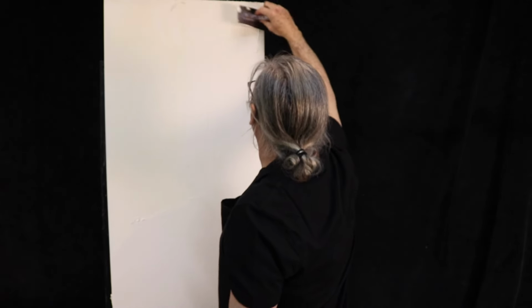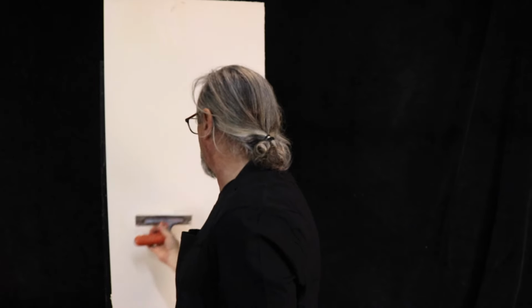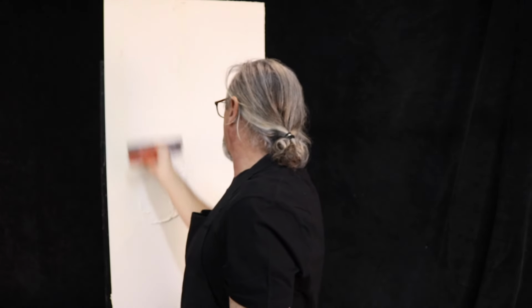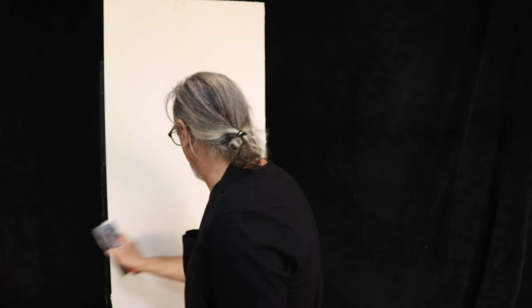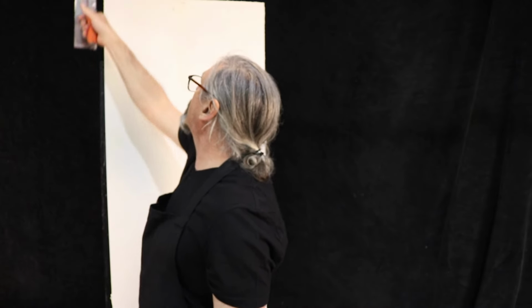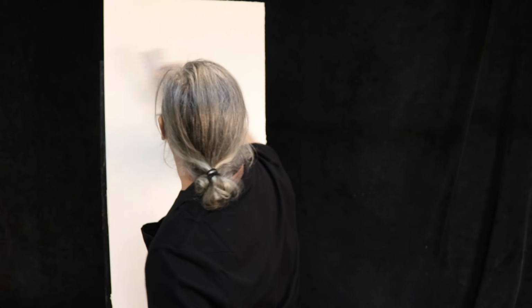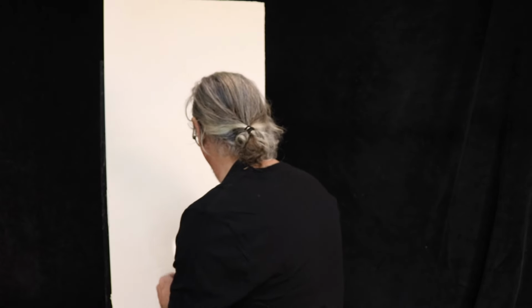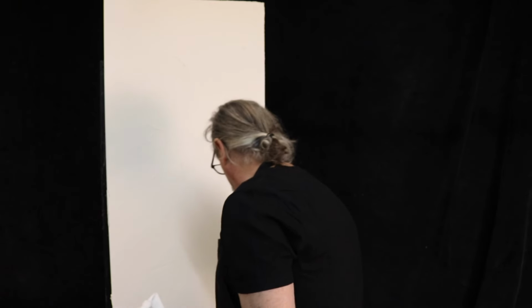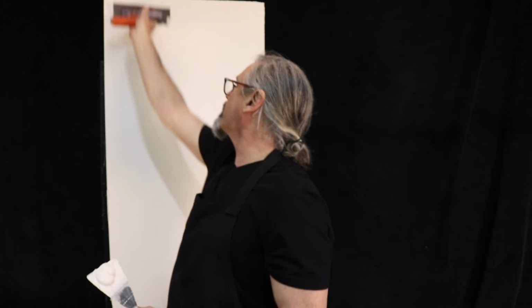So I'm just going to use the Marmorino, cover it, work it out. Don't want a lot of trowel marks. We don't want it sloppy, but we don't need, oops. Oops. All right, just keep troweling this down. So we're just going to put it on kind of thick. That's about 1/16 of an inch probably, 100% coverage. It's a little busy, just going to even it out for that nice look of mortar.